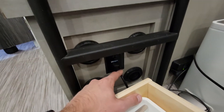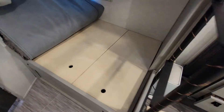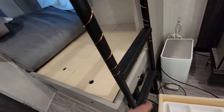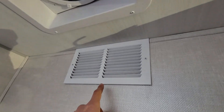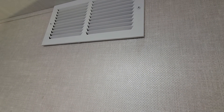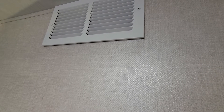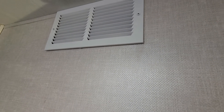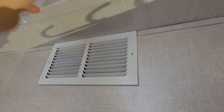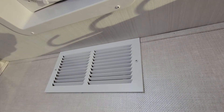These aren't actually hooked up to ducts or anything like that. Because that inverter charger is in there and I drilled these holes in, I want to have a natural cross breeze — and obviously hot air rises. So I put this vent here so that the hot air can rise up, because it's cut on the underside. On the other side at the bottom it's open, so it doesn't have paneling on the other side. That way the hot air can rise up in the wall cavity and just rise up out of this and have that natural convection going.